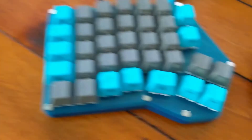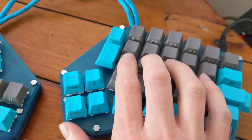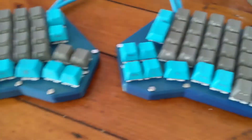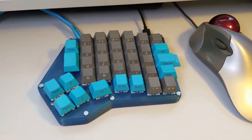Now a quick test. There are a few Pico keyboard projects knocking about, but it's all fairly new so any information I give here will be out of date. I wrote a quick MicroPython script which tells me the row and column for any given key so that I can check everything soldered correctly. I've got rubber feet on order, but it's about done.